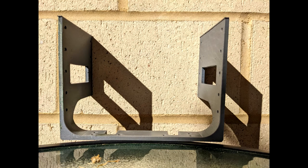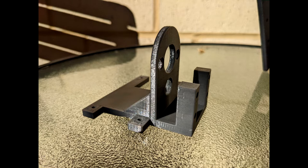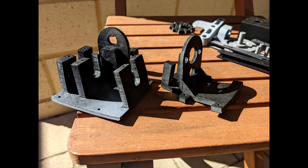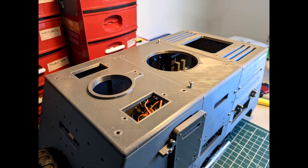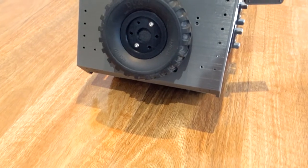I've been leaving a PETG piece in the sun, trying priming and painting and seeing how they go — so far very impressed with how PETG is going. Leaving motor mounts in the sun, no problem at all. If you compare that to how the PLA+ prototype parts look, they've just completely warped and are unusable. So the moral of the story is: PLA or PLA+ — if it's PLA, it's no good for outdoor use, prototyping only. With that in mind, I started printing more parts in PETG. The top plates you can see here with that nice sheen — that's all PETG.